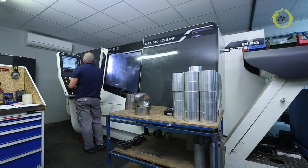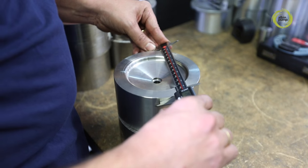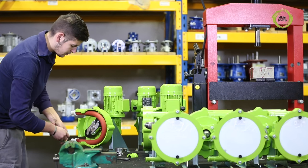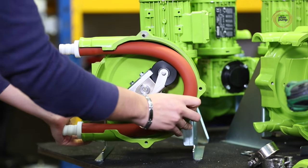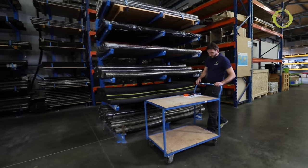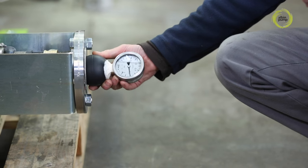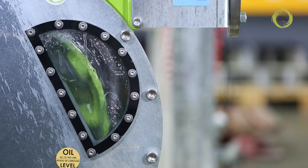The pump's strategic mechanical parts are produced on our state-of-the-art machining centres. Pumps can be assembled as a one-off job or in a production run. The final assembly operation involves fitting the hose into the pump. We carry a large stock of hoses in a broad range of materials to specifically suit the liquid being pumped. Every one of our pumps has its suction characteristics tested before packing and shipping.